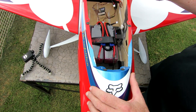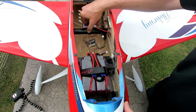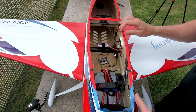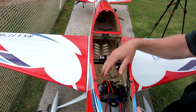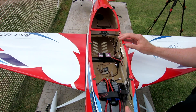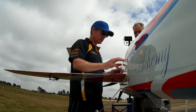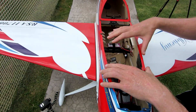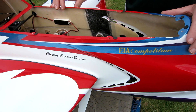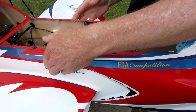Inside is the main power battery pack that supplies the motor. We've also got a much smaller separate battery that we use for powering the control electronics on the aircraft — that's really for all of the onboard servos. From a safety perspective, if we do have a low battery problem or an issue on our main power drive we still have full power to the rest of the aircraft. So if we do have a motor problem, even though we might not be able to glide for long, we've still got full control of the airplane.